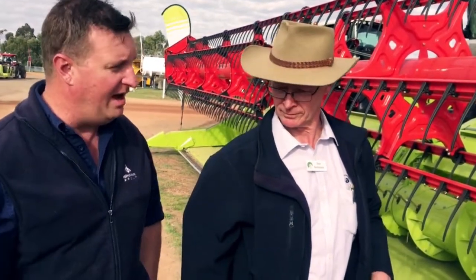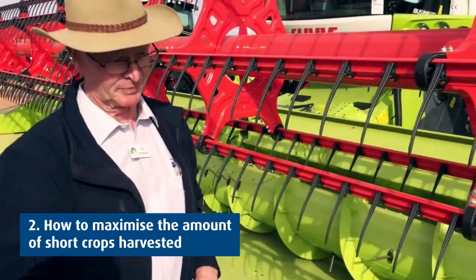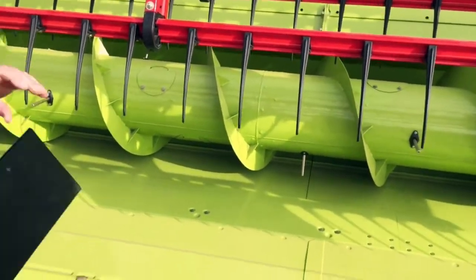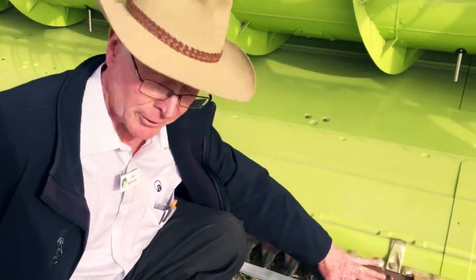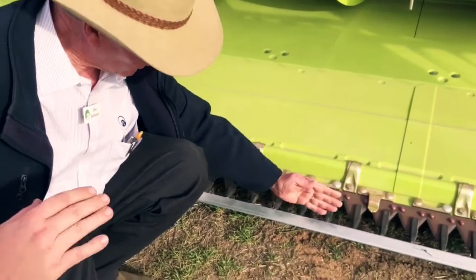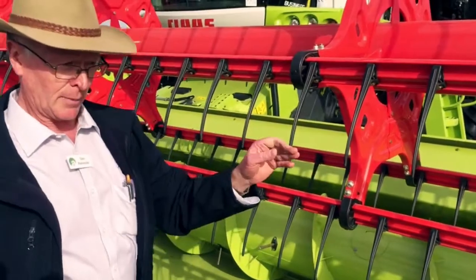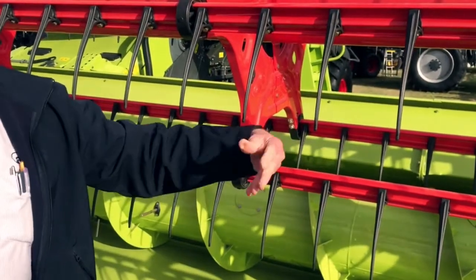Aside from making sure the knife is ready to go, what about maximising the amount of material we're getting in the front there Glenn? How do we get around those light crops? Well, one of the problems with these conventional fronts is the material will be cut okay, but then it tends to sit just here behind the knife and may fall forward out onto the ground. So we want to push that back in. These pick-up reels are good for picking up a down crop, but for just sweeping in a crop they're generally a little bit too thin — there's only a finger every so far and it's just not enough to grab those short heads in.